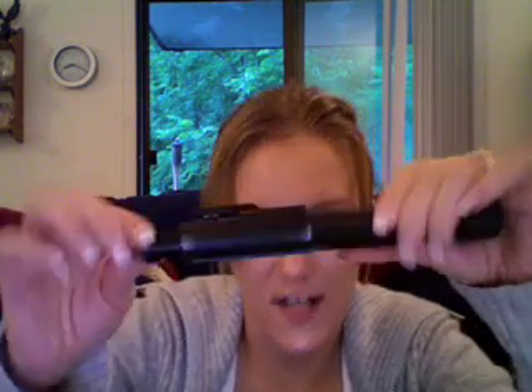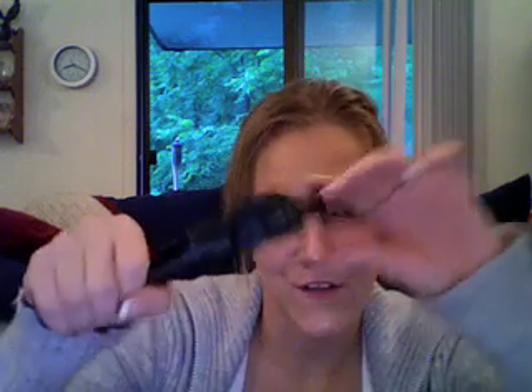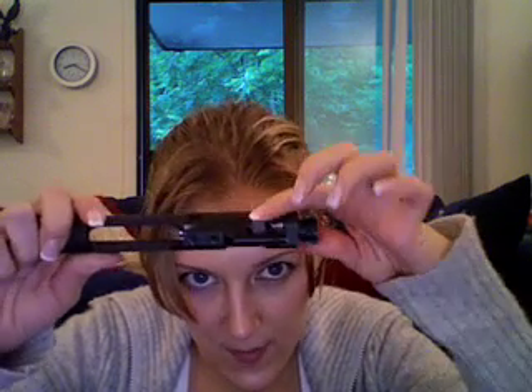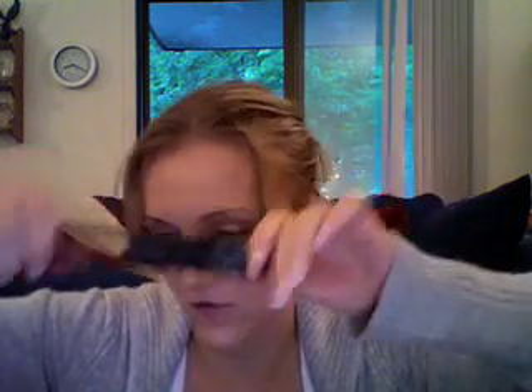Now do a quick functionality test — move your bolt back and forth. You can do a snap test by pushing it forward and flicking it, and your bolt should fly out. You should be able to shake it and your firing pin should not fall out. When you put your bolt carrier group back into your upper, make sure your bolt is in the forward position and that your cam pin is directly underneath your bolt carrier key. If it's in the back position, the cam pin will get hung up on the side of the upper, so pull that bolt forward.